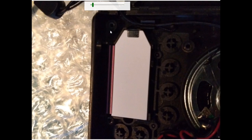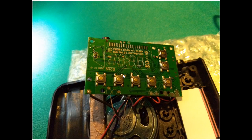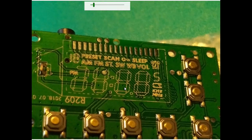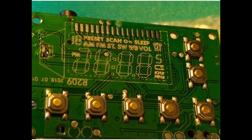This is the back side of the LCD itself. You can see it just kind of lays in this plastic surround, and it has one of those zebra strips — a kind of elastomer rubberized connector that makes contact with the display and the PC board. On the back side of the PC board, they have the silkscreen of what's on the display printed on the board. That zebra strip I was talking about is over in the lower right corner — that's what makes contact with these pads for the LCD.